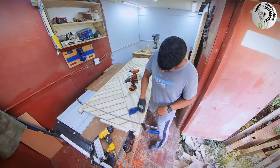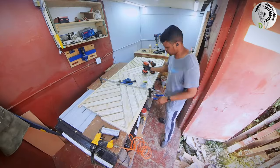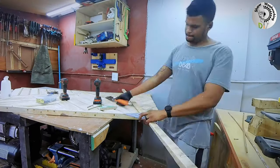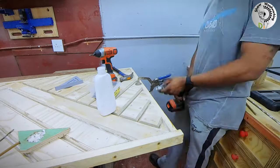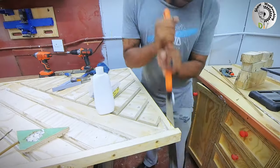I added trim on one side and then on the other side as well — glue, screws, and also some dowels. I used quick clamps to keep the trim flush with the top side of the door, which is the business side. My trim wasn't cut to the exact width since my table saw just died, so later on I'll need to come back and hit it with a flush trim bit on my router.